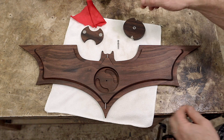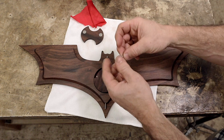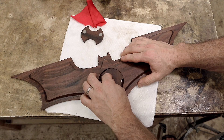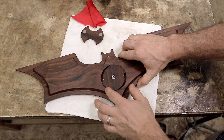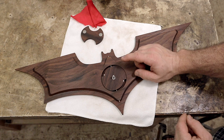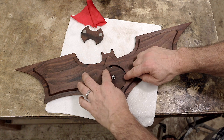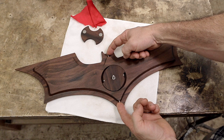So let me show you the assembly. The center ellipse will go ahead and drop in with the magnets. I push the nail into the center and I will eventually use a dot of super glue to hold it in. So here you can see how the ellipse will move and move the shafts. One of the problems is the shafts won't move inwards when the hole gets larger, and so that's the purpose of the magnets — to suck it in. So it sucks in all at once to unlock it. And then to lock it, the elliptical shape will push the shafts outwards and lock into the grooves in the box.